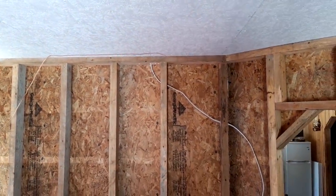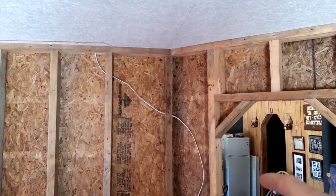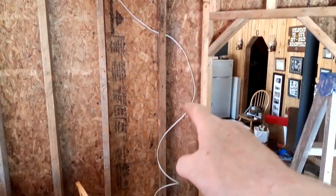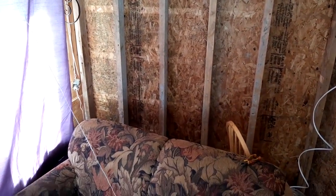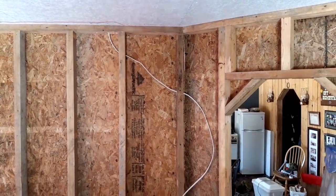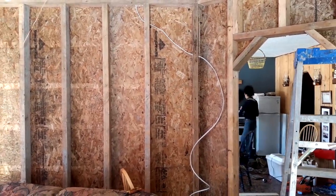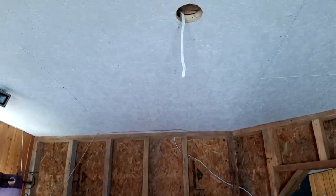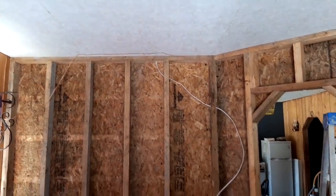Now I've got to pull some back — I have to run it to a light switch right here. So it'll run down to a light switch there, then from the light switch down to a receptacle, and from that receptacle on over to the receptacle in behind the couch, and then we will have lights in here. Heather's out right now cooking me supper because it's got to be getting after five o'clock. So I'm going to pull this on through — I'm going to leave a little bit of slack up there just so if I ever have to, I can pull some through later on.